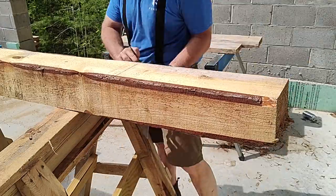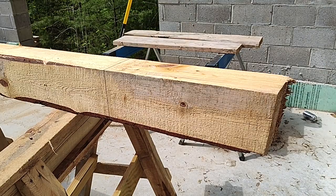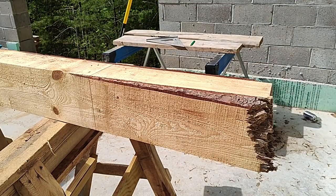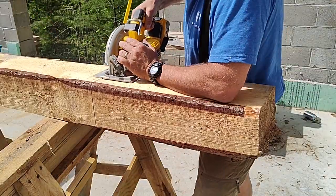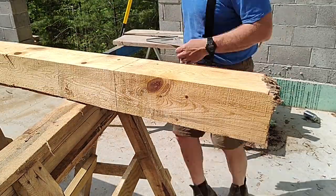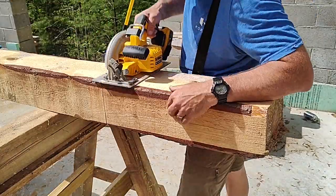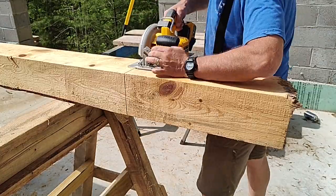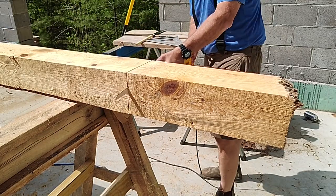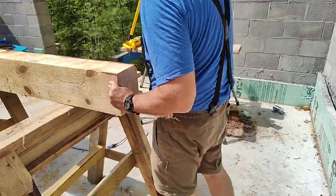Now for the top of the post — I went to pretty elaborate measures to ensure I'd only have to cut this post one time and that it would be perfect, and I'll talk about that in probably the next video. I settled on the exact measurement, was very confident with it, and made my cut — going around all four sides with the skill saw now that I know it's perpendicular, then chopping it off and flattening it up. I really didn't want to get this timber up in place and find out I need to shorten it by a quarter inch, or that it's just a little too tall or short and I need to shim it.